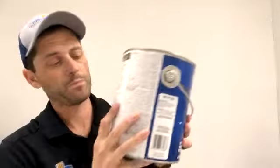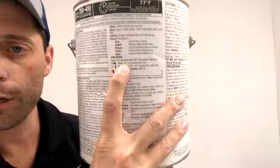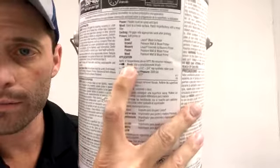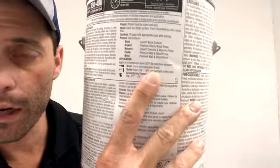And if you can't remember that when you're in the store, take your gallon of paint and look right here at the back — it will actually tell you which type of brush to apply. It'll say to use a polyester nylon brush, for example. If you can't remember, just look on the can. It'll tell you plain and simple. Thanks — this is Justin from Imageworks Painting, and good luck out there.